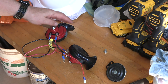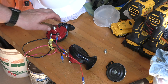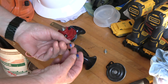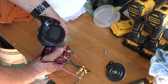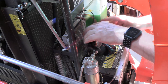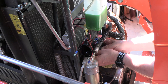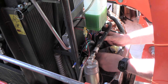Here's my horn system — the two horns, the high and the low, each connected together at the same terminal. For these leads, we join those so that the horns are in parallel. These will be the connections we'll hook up on the tractor, and we'll see if we can mount both horns using that same bolt hole — one like that, and one like this, lining up that hole for both of them.